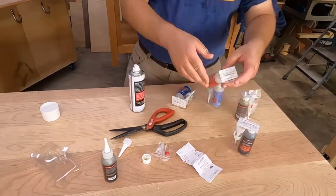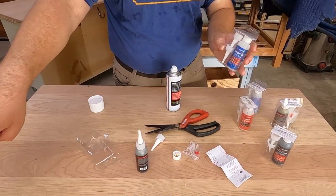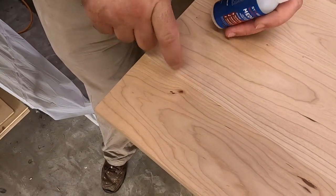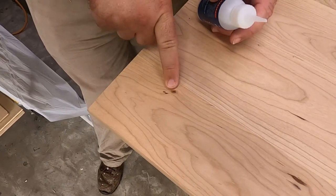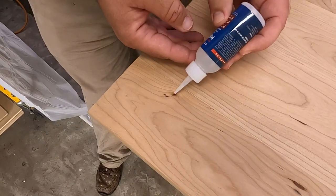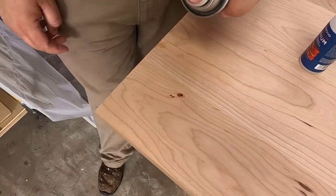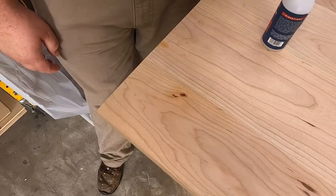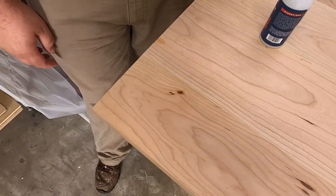What I'm going to use now is the medium — it gives me a little bit more flow for this little clear spot over here. I'm going to use the clear medium right in this hole. I could use the black and the brown, but a lot of times the clear, once it goes in, will match the hole just fine. So we're going to put a little dab in like that, spray our activator, and you can see it's already starting to dry. We're going to let that set up for 20 to 30 seconds, come back, sand it smooth, and then that little gap will be filled.